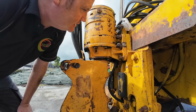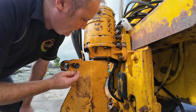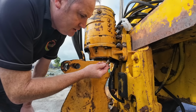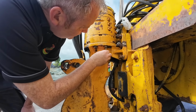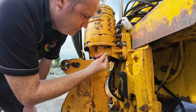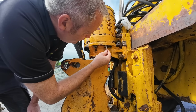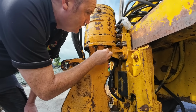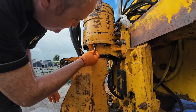So I rung a few places seeking to get a socket set. I was just going to go and buy a decent Allen key socket head for this. But I may not have to do that, because one of the lads mentioned to me, just in a local car shop actually, just put a bolt up on it and use that. And that's a bolt there fits, and look it, it's worth a try. I have a feeling it'll shear, but I'm going to weld a nut onto the end of this here. I'm going to stick a ratchet onto it, I'm going to try it before I go looking to buy a socket set, because that'd mean I'm away for the most of the day and I'll not get it done the day. I just welded a nut on the end of that bolt, so the bolt will fit up in here.